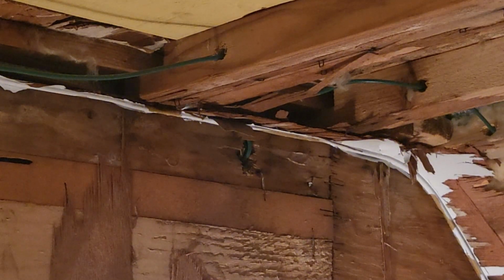Put 2 inches of foam board in the top, so 1.5 inches to come flush with the strut, where that green wire is, and then 1 inch over top of that to cover the seams. Screw into the studs, and then that will hold everything in place. And then, do I do sheeting over that on the roof, and then frame the walls out under the sheeting, which is what they would have done previously?